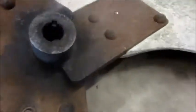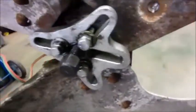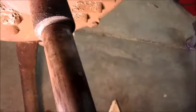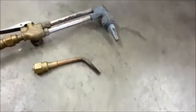That right there is what you call a very, very formerly stuck hub. I had to heat that with the torch and run that puller all the way down to the very last. And man, that is brutal. The fan I just got through with — this nozzle provided enough heat to get the hub off — not on this one. I had to change to this size, and that still barely did it.